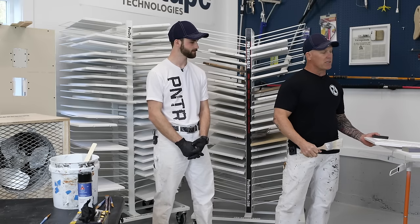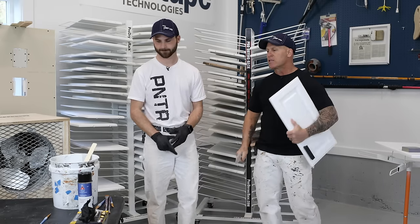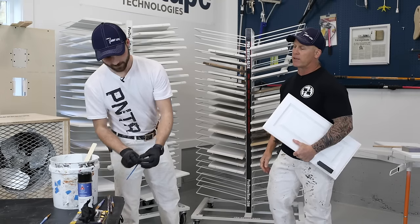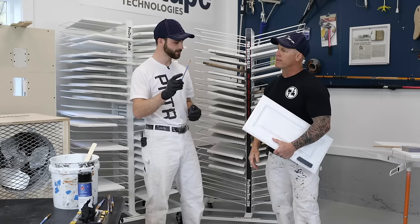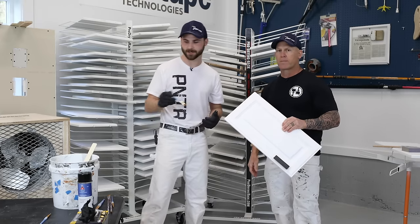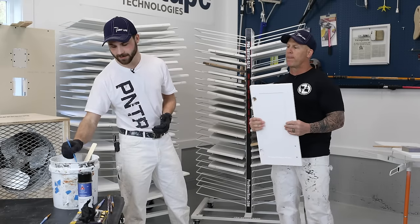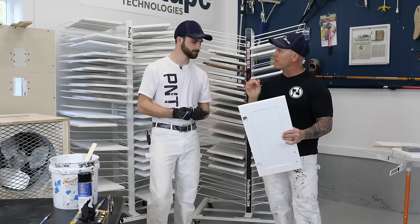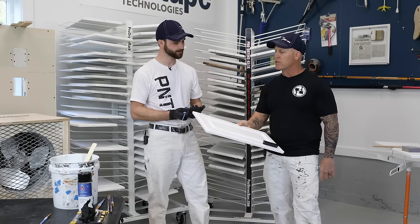But we're gonna deal with this nick right here now, Zach. So what are some of the things you're gonna do when dealing with this nick? You're gonna select the right brush. And then you don't wanna just brush it like I was saying earlier, you just wanna daub it. So we're just gonna take a little bit of lacquer on the end of this. So you're kinda just using a daubing method where you're just gonna daub it on that nick and not brush it on? That's correct.